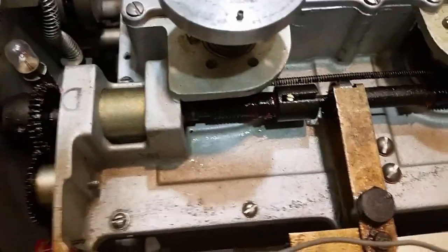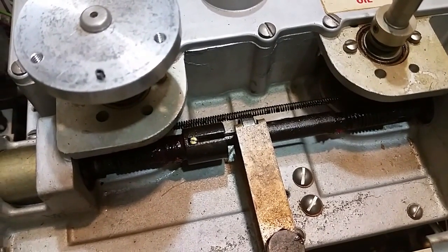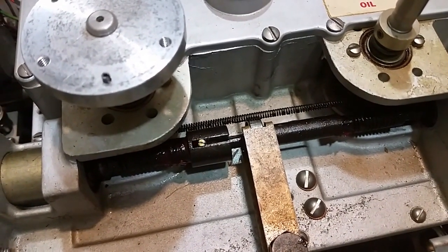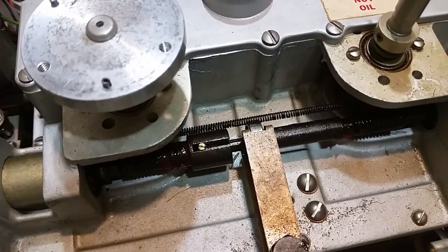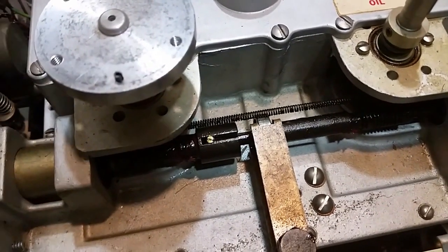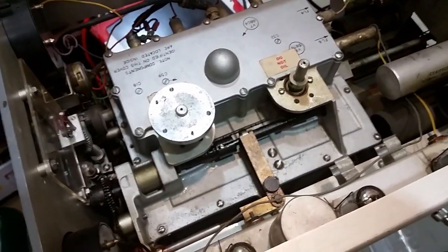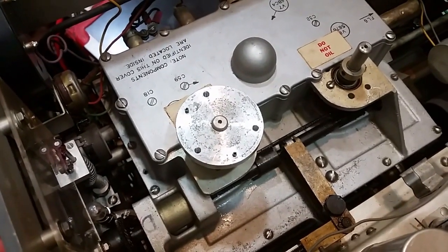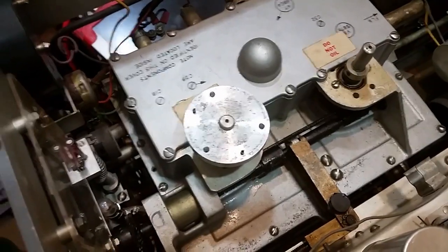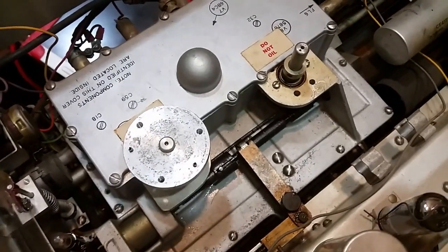There's not a separate capacitor for the peaking. Instead, once you tune to a frequency and you want to peak, what you're doing is actually driving that back worm gear by either lengthening the shaft or reducing the length of the shaft. So that's pretty incredible. I usually am a proponent of being careful about not over-lubricating, but I have lubricated this pretty extensively — even some of the places where it says do not, I've put a drop in there. At this point it's turning very smooth with no resistance at all. There was definitely some resistance earlier; made a huge difference. I basically kept oiling and greasing things until I couldn't tell any additional difference.